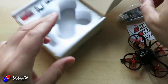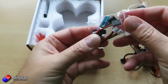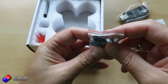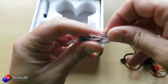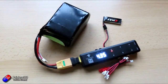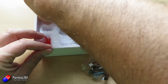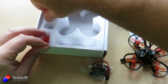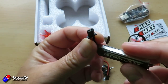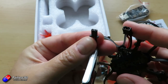Including the pack, you get a battery charger with a couple of different battery connectors. There are also a couple of adapter leads in here, which you might need if you want to charge the batteries on an existing charger. I tend to use my TBS one, and this is using the GNB 27 connector — a more robust connector that I'm starting to see on more modern models. There's only one battery included with that connector, a single cell 300 milliamp LiPo, which will give you about three to three and a half minutes of flying.